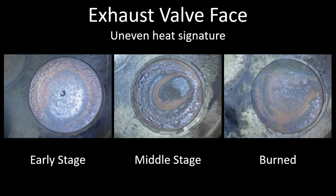Now I want to give a caution about relying solely on color in an exhaust valve. Color is greatly affected by white balance — what is referred to in digital photography as white balance. Basically, if you have a light source like natural sunlight, a fluorescent light, an LED, or an incandescent bulb, they're all going to have a different color temperature. Some are more yellowish, some more bluish. And what that does when you're taking a picture is it affects the color of the object you're looking at.